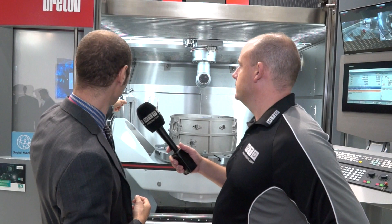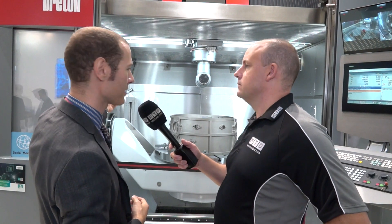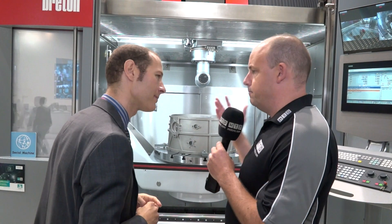I'm assuming you'll have all the necessary probing for measurement of the part as well? Yes — we can have mechanical and laser probing for the tool, and electronic probing for the part. We can automatically correct and compensate, and we can also implement the Renishaw Sprint, which is a continuous probing system.